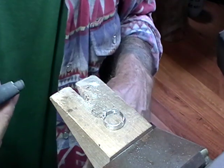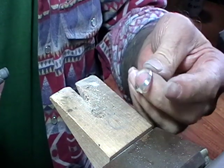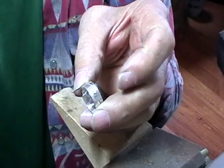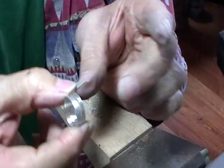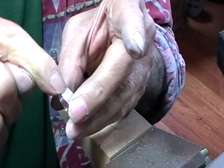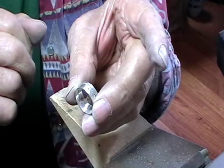Then onto your wooden ring stick and polish it on a cotton buff with Tripoli. Then wash it and polish it on rouge. Put the rings together and put them on the wooden ring stick together, because you don't want to round off any of the inside edges — you want to keep them flat, and the way to do that is to keep the rings together.